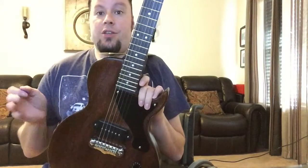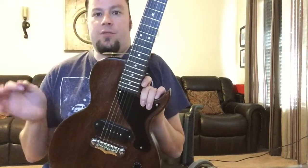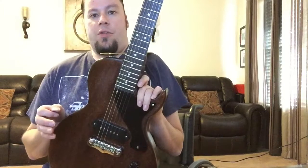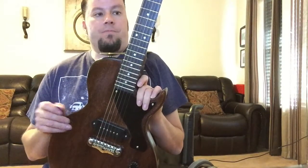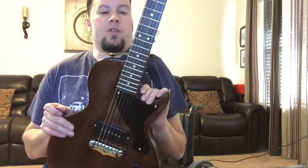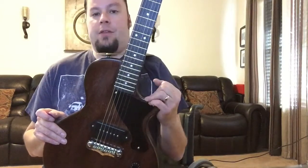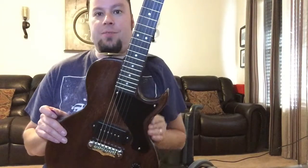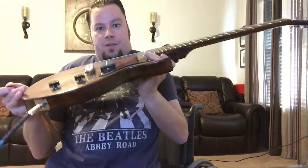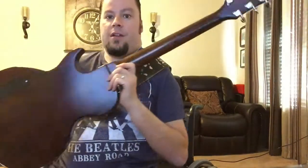I did use the Wood Tone top coat, vintage aged, top aging coat tint on top of the Minwax stain. And if you're running into the same problem with the sanding sealer, but you still want to use a thin kind of top coat, you can still use that with a Minwax stain. Not even the guy at Wood Tone knew that. I'd asked him that question. He was like, I don't know, I just gave it a try to see how it came out. And as you can see, it looks great. Now, we don't have a mirror shine, but it's still nice.